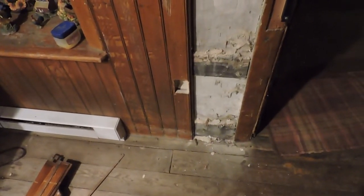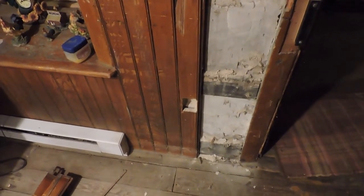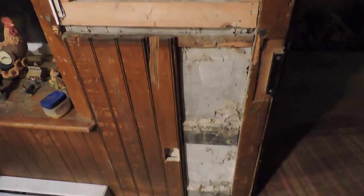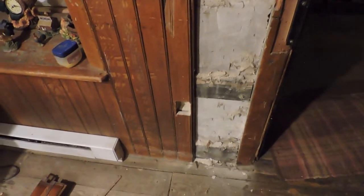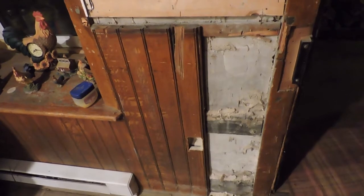My first thought was, well, I can just cut some holes in this wainscoting that's here and then just snake wires in behind, but as you can see, there are boards that are nailed into the plaster, and really that's a skim coat of concrete, a 2-foot thick stone wall behind there, so I couldn't run wires in between. I'm forced to pull the wainscoting off.